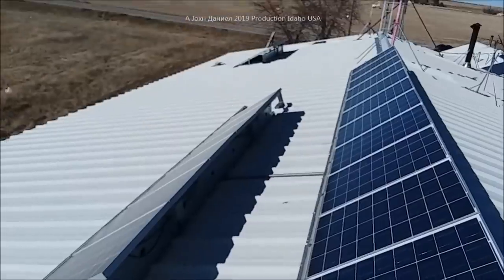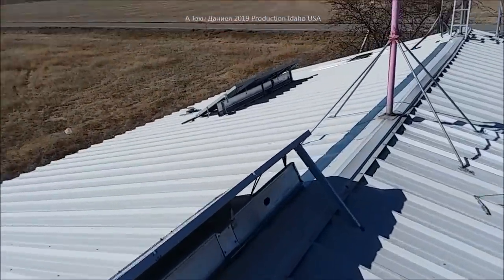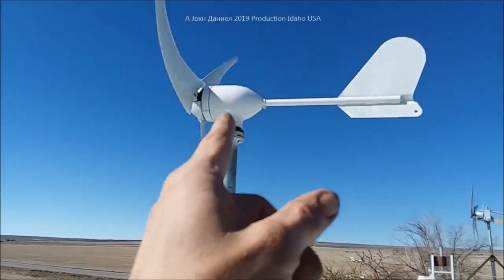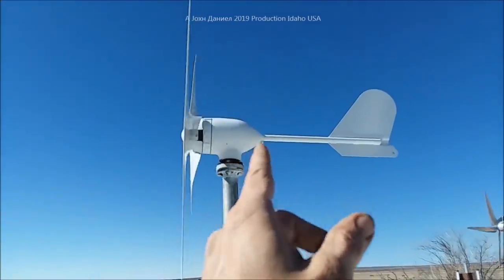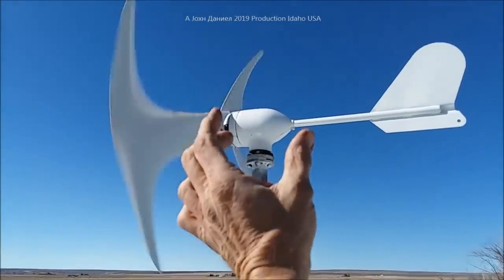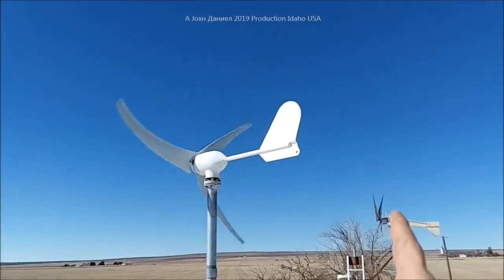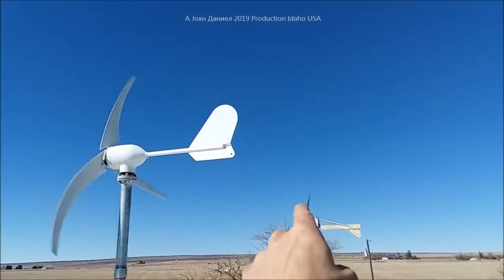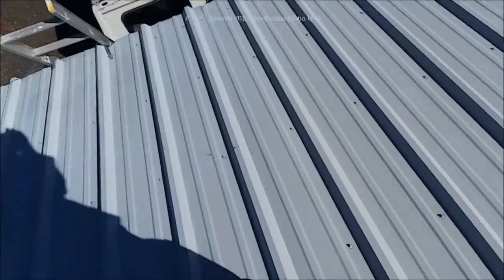Just giving y'all a little update. I'm not up here to brag on my little China wonder, but they lowered the price. Not only did they lower the price, look how big the PMA is — it goes way back — it's huge. 10 magnet. The one over there is a 10 magnet also. I water-cut all the core parts, made it 10 magnet — that's why it produces 600 to 700 watts. The ones you buy off the shelf don't do that.